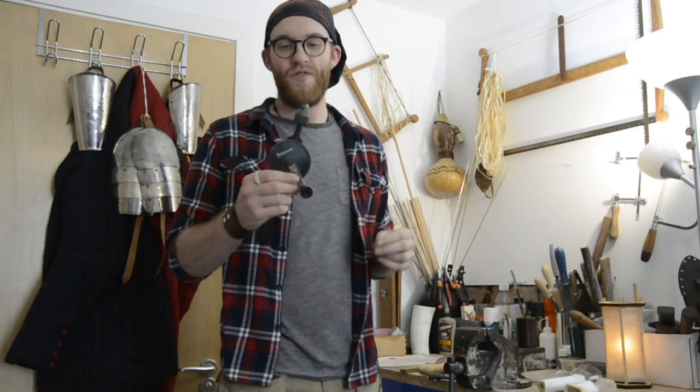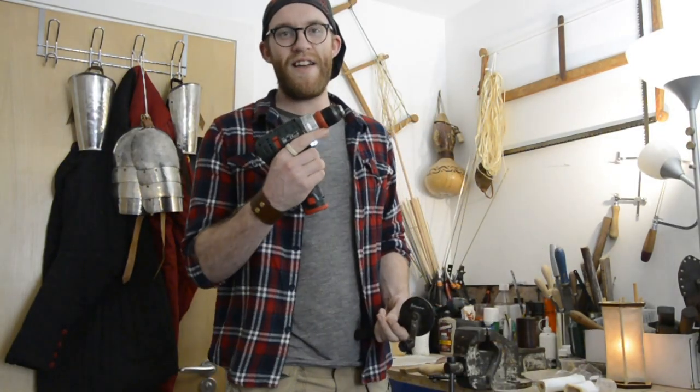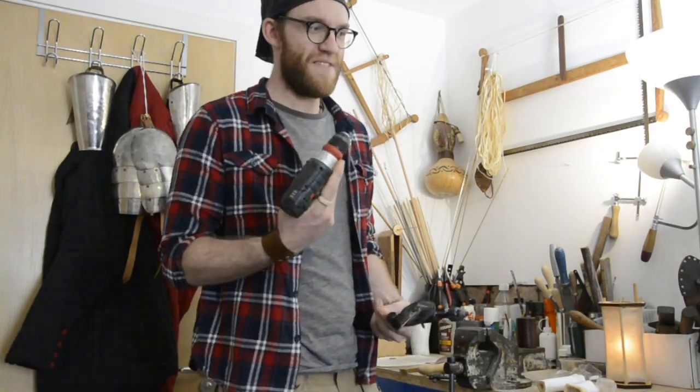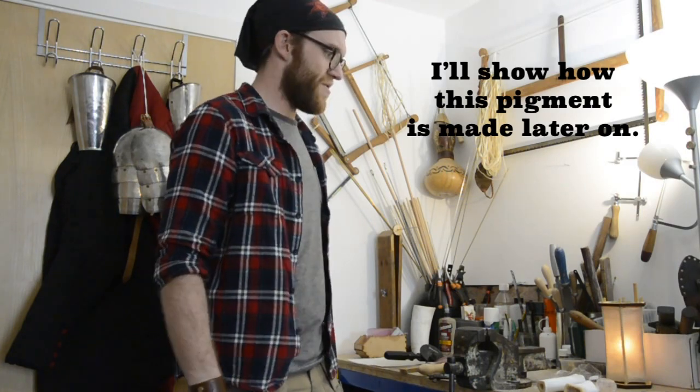And you'll need a way of marking out the dots, and I find the best way is to drill in with a 1.5mm drill bit in a hand drill, like that. You could use an electric drill if you're very careful with it, but they're kind of clumsy, and this is what you want. Right, and finally you'll need something to fill in the dots, and you can use model paint. That works fairly well, although it tends to chip out a little bit if you use them a lot. My favourite filling for the dots is a mixture of beeswax and charcoal. Cool, I think that's everything. Let's crack on with making it.